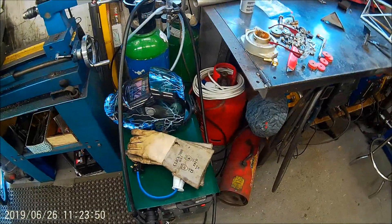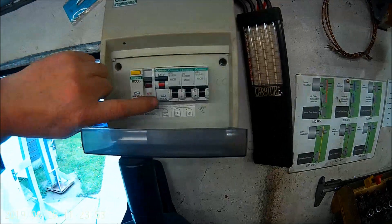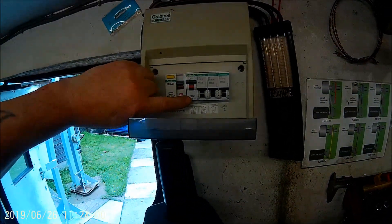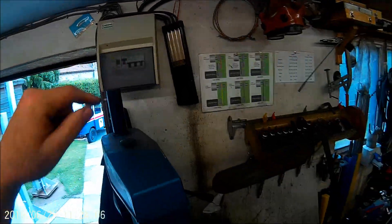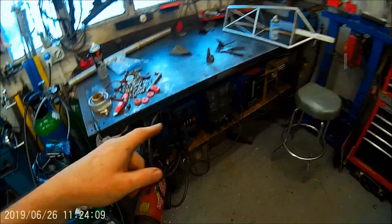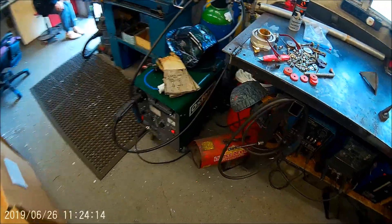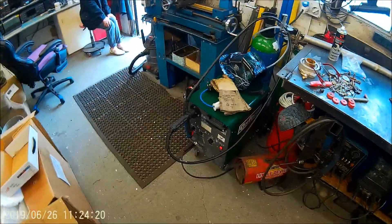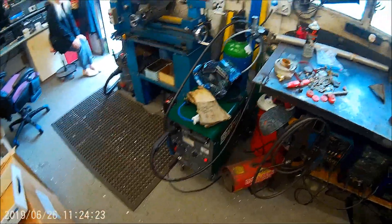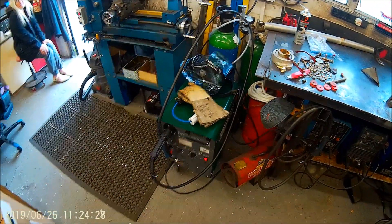The trip — that circuit is on a C-32. I found that the B-32 I had in there before would trip out occasionally, even when I had the TIG welder on, so looks like that's doing a fine job. Right, thanks to Oxford and MigTig Arc at Portsmouth who sent it up for me — get practising with that, sure it'll work out wonderful. Thanks for watching, see you later.